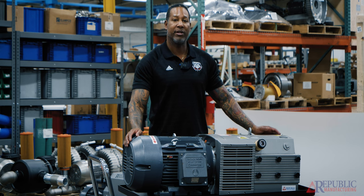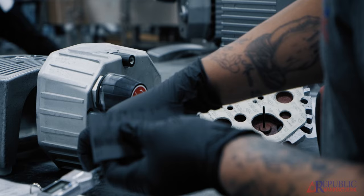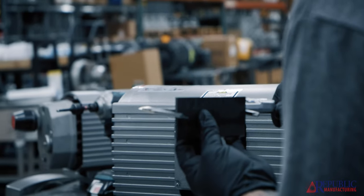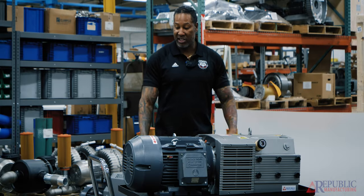So if you have something like thermoforming, we have a different technology you would use for that. For maintenance, you have to keep the filters clean, and every now and again the rear plate has to be removed so you can measure the vanes to make sure they meet the minimum height the pump requires. If they go beyond the wear height, or something overheats, you could cause a catastrophic failure breaking the vanes inside the pump. You've got to change the vanes — they're carbon, so they wear.